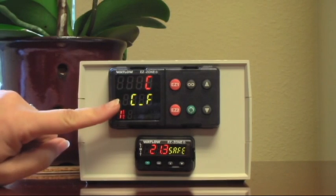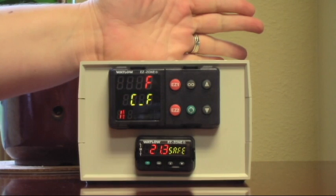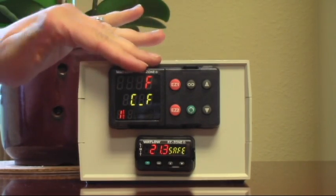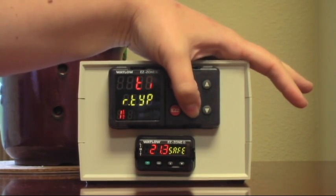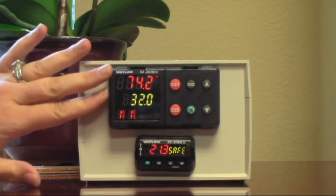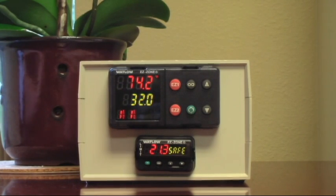Green key to advance. And it's real simple — C or F. The up or down arrow toggles between the two. If you want to use the controller in Kelvin, you're just out of luck. So you want to pick F. And then, as always, with any of the things that we do, you can press the green advance key to back out, or you can press the infinity key to return to your home screen. And you'll see now that it reads degrees F right there, and that it's changed the values to Fahrenheit.